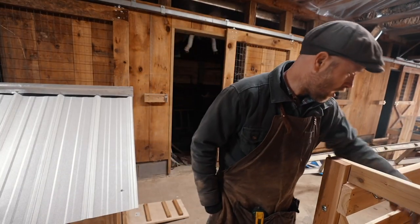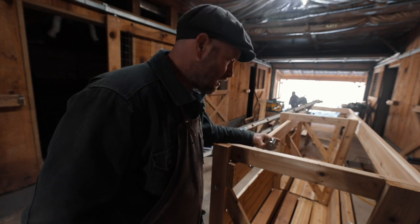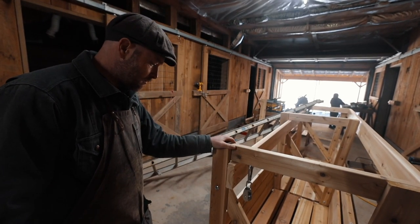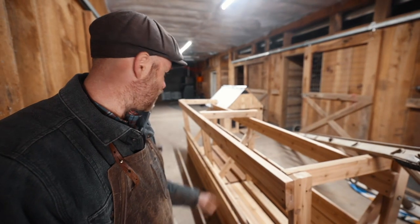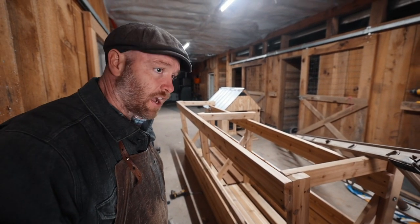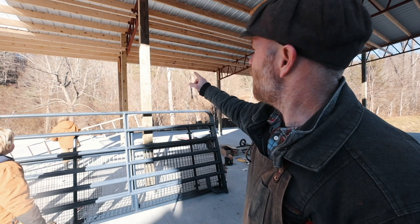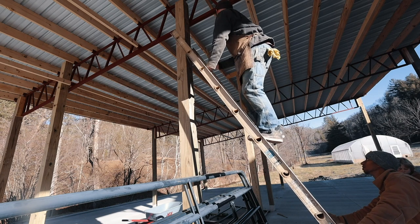This is so hard to get the right hardware because it depends on how many hay racks you're going to build and all different kinds of things — like whether you need a smaller or bigger pulley. We're only doing one, so we're figuring this out. Most of you aren't going to build more than this — this is for five cows, two feet per cow is what you want to go by. I'm thinking even for sheep this is overkill. I put the posts at ten feet apart — that's where we're going to hang our feeder.